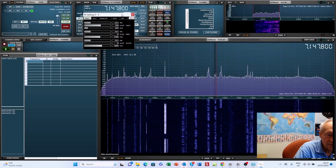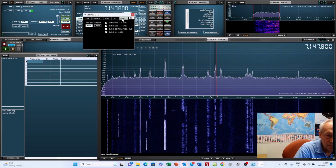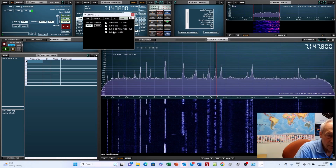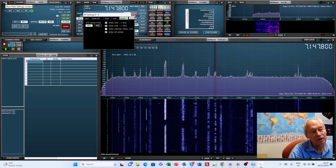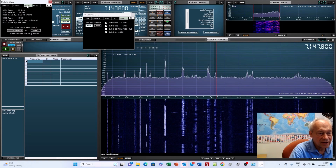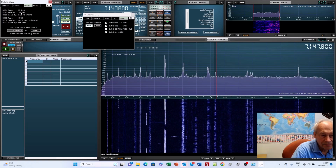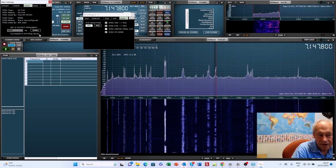This is the VRX settings control window, where you'll see there's a tab for Omnirig called ORig, and these defaults should be fine, but just make sure you've got rig 1 selected and these default settings that you see here. Over on the main panel, go to the settings there, and again scroll along and select ORig, and if everything's working well, you should see that the rig 1 status is online, and you've got a little message here saying connected to the Omnirig server.